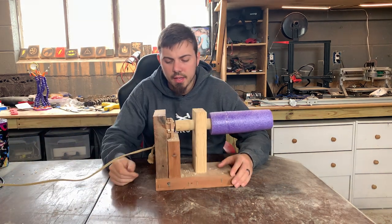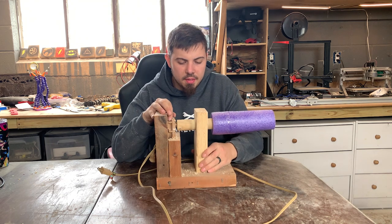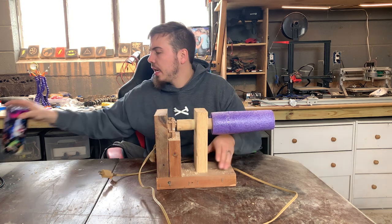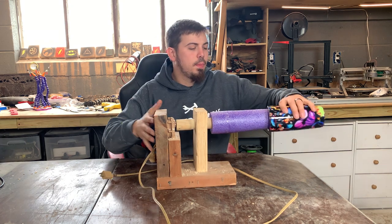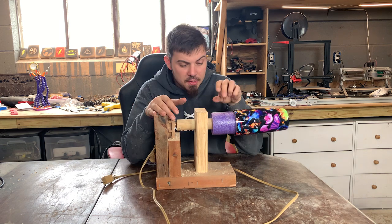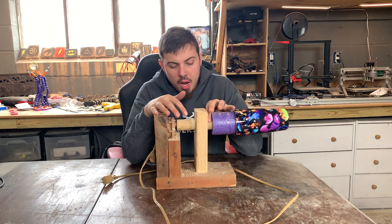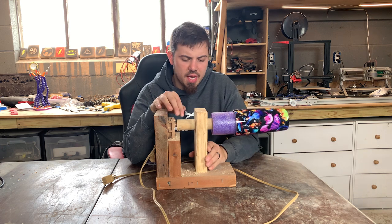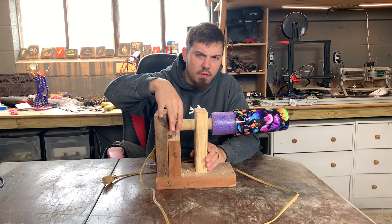After a couple iterations, I came up with this. All there is to it is a motor that spins — you got your shaft coming out. This is a pool noodle, which actually holds the cup on it like that. You want something that kind of expands. It's got the pool noodle and the rod. The reason I didn't just come off the shaft is there's a lot of weight out here, so I added this so that all the weight is off the motor.